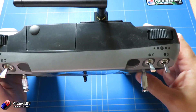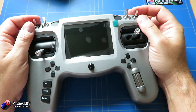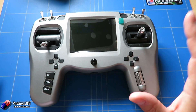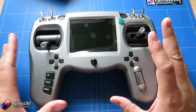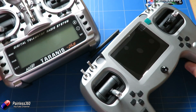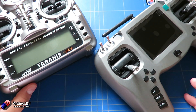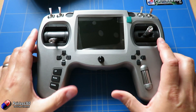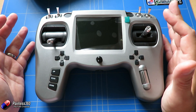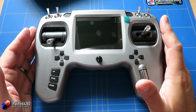The other thing to talk about then is the switches on this thing. There are a couple of spring-loaded sliders at the top, a couple of two-position switches, and a couple of three-position switches as well. Now the thing that surprised us when we first got it here is that this isn't a full-featured radio — but it's not designed to be. In here there are no dual rates, no trims, no advanced sophisticated setup options. So if you are a new pilot and you're looking at something like the Taranis and the 27-odd videos on the channel confuse the heck out of you, and all you want to do is fly, then this is a much simpler option. It's designed to be easy to set up for things like CleanFlight, BetaFlight, the DJI Naza V2 which is directly supported, OpenPilot, TauLabs, Blade, and things like the Tiny Whoop. All that stuff is available through here with a very limited set of setup options.